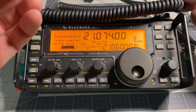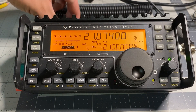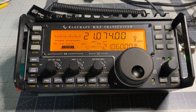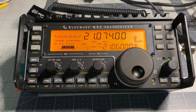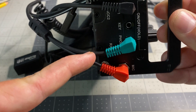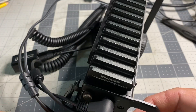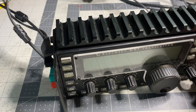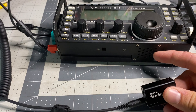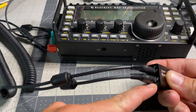What I did is I went to Giga Parts — I'll put the link in the description — and bought the Elecraft KX3 kit. There we go, we want to see that beautiful screen. It came with this USB-C cable, the DigiRig, and the KX3 connectors. This is about $100, so add that to whatever you purchased your KX3 for. The green connector goes in the headphone jack, the red connector in the mic jack, and this one in the accessory jack. The top one is the power cable. Make sure the right cables are going to the right DigiRig — this one handles sound so it goes in the audio port, and serial goes to the accessory jack.